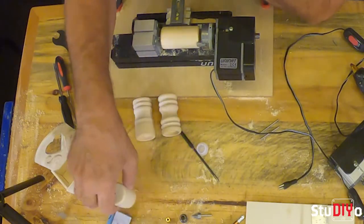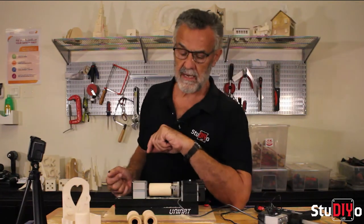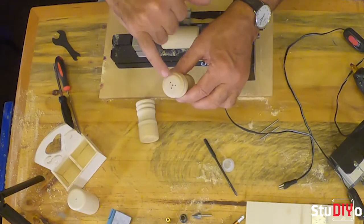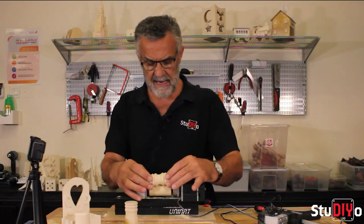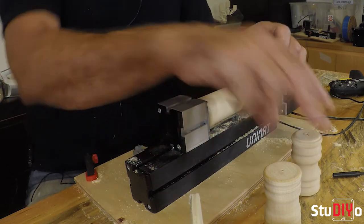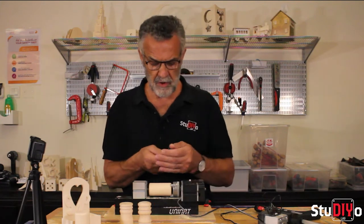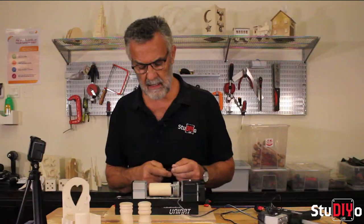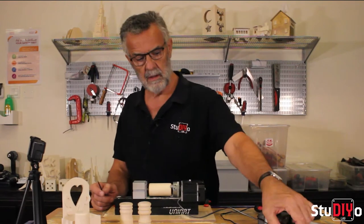I've got two examples I've made here — you can see I've chosen to do the salt and pepper differently, one shape for pepper and one for salt. A nice challenge is to try to get both identical; the only thing that distinguishes them is the number of holes in the top — a single hole for salt and several holes for pepper. I'm going to start at the top end, which will be the top surface of my shape. With the cutting tool, two hands, we never touch the wood without resting on the tool post — nice and firm — and I'll start shaping the pepper.